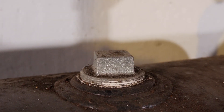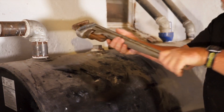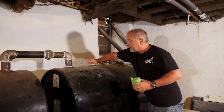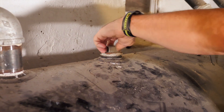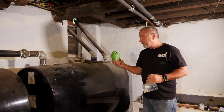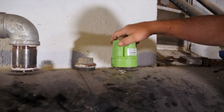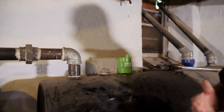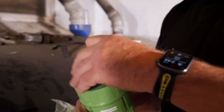With this tank we have an extra opening — what they call a bung — that we can put it in. This is plugged. I've already loosened this because I didn't want you to see me grunting, as they can be a little tough. So this is already loose, but it's still going to fight me every inch of the way coming out. This is a two-inch hole, two-inch plug, but we're going to do a dry fit to see how it fits. It does go all the way down. We're going to use the gasket for sealing. Sometimes the threads alone will lock it in, but here we will use the gasket and we don't want to cross-thread it.